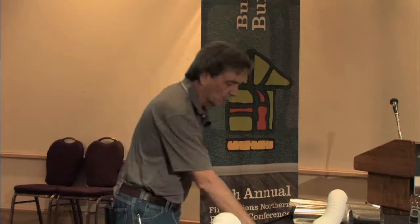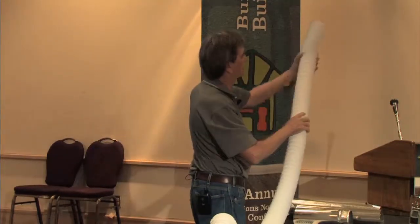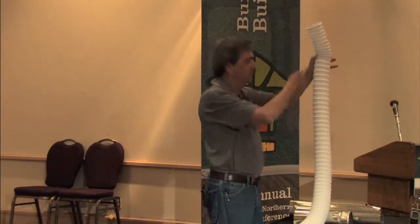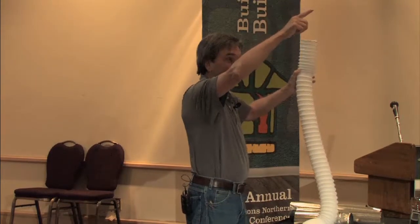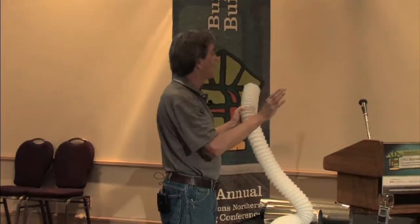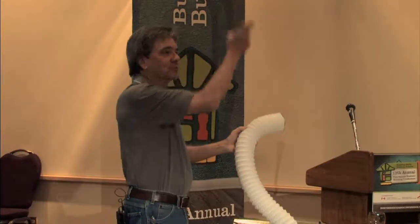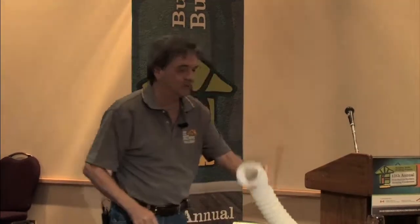And so the way we found this out was this one contractor started successfully selling R2000s to Ukrainians. What he did is he took one furnace run that came all the way from the furnace all the way up to the master bedroom and did nothing in between. And so any sound had to go down to the furnace and all the way back up to the kids' room. And that worked. And then he weather stripped the door and they were happy.